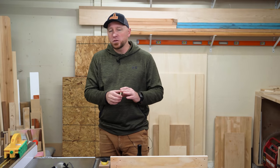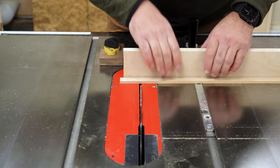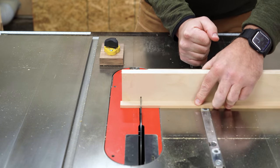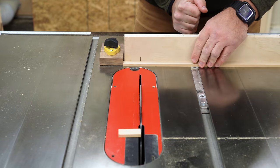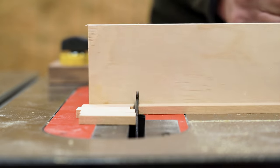Today I want to share three ways that you can prevent this from happening. One: if you are using a miter gauge and a stop block — which is the most productive method if you have a lot of pieces to cut — extend the miter gauge's fence wide enough to support both the material and the offcut, and push the material all the way through until you completely clear the blade.